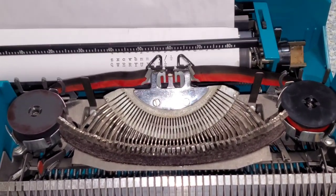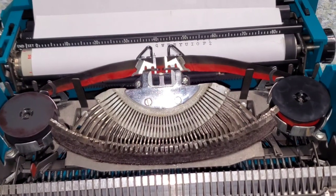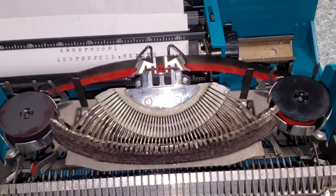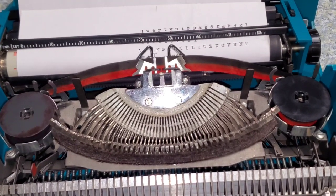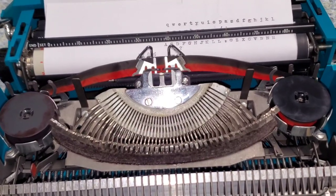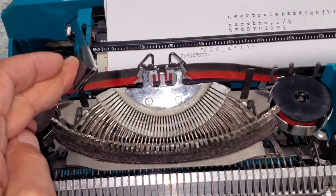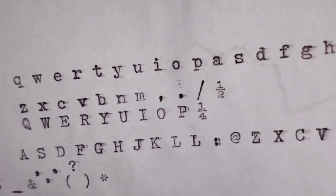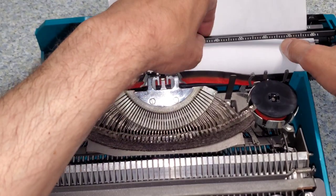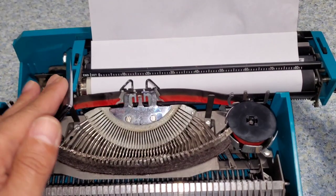It's likely that this typewriter came from the old Winona, MN courthouse, as its previous owner was a legal secretary there from the 1930s until the 1950s. L.C. Smith Super Speed, serial number 1,452,332-11. This was a teaching typewriter — all of the letter keys are blank so the student would have no choice but to memorize the keyboard layout. The blanks are just black plastic or celluloid inserts; the letters are present underneath, and the inserts have cracked and come off of a few keys revealing the letters. Remember the unusually late right-hand return on the Super Speed Silent above? These two Super Speeds were manufactured very closely together — probably only about one to two weeks apart in late 1938 — just goes to show that you can't assume anything about production standards.